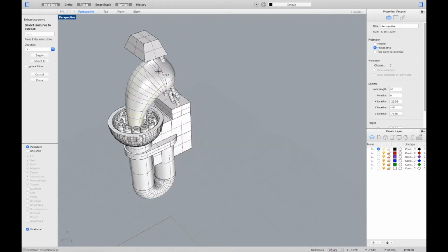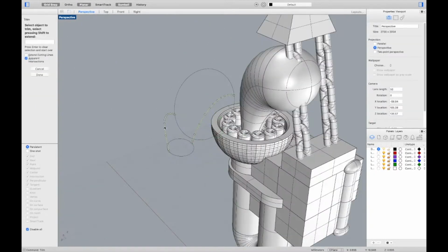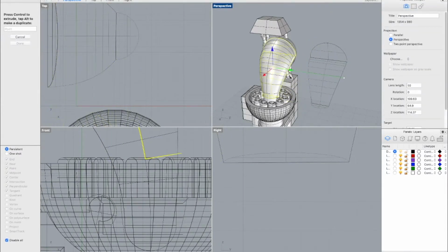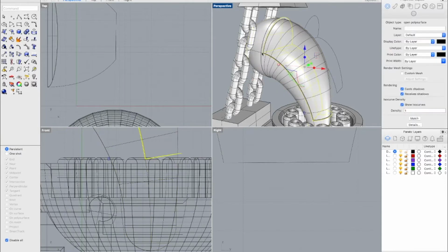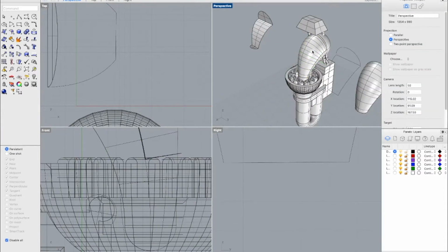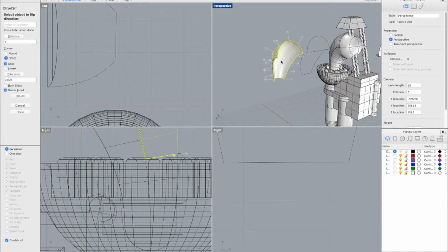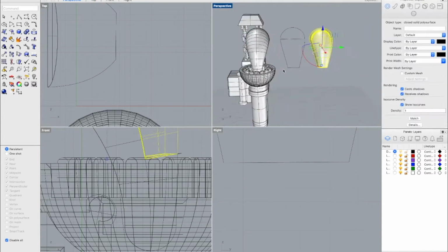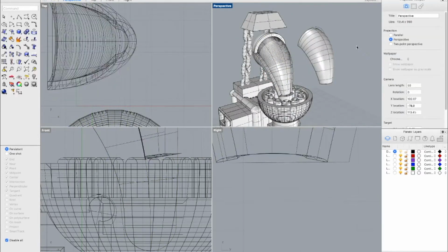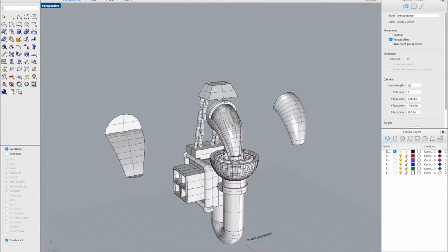In this section, I'm preparing the final sketch to have a cast stone set pave component. I do this by using the command extract ISO curve, which draws a line along a 3D surface, which I then use to cut out a section of the surface. The cutout section of the surface is then given a solid form, which will be subtracted from the main body. After my final draft is printed and the pave component is cast, the cast piece will be able to key tightly into the main body of my piece.